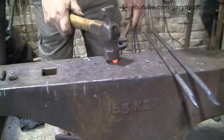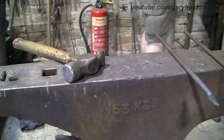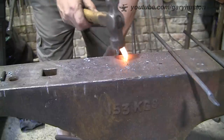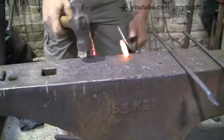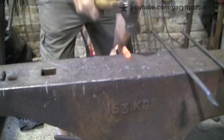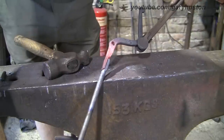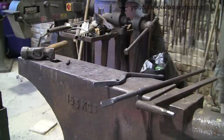If you're worried about damaging the rivet hole, you could always leave the rivet hole until you've got your reins on. Or if you're going to draw your own reins out, draw them out then put the hole in. To be honest, I didn't even think about it, but I probably would have been better off cutting these off, doing the scarf, welding the reins on, and then punching them. But I didn't think about it and I'm not that bothered. You can see it has slightly distorted the hole - I can easily punch that out again.